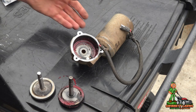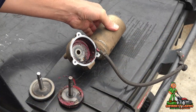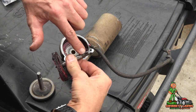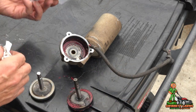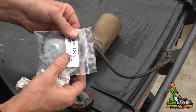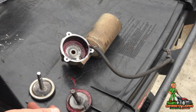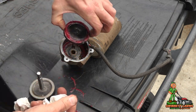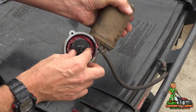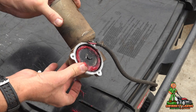So I've got the motor and everything away from the mower and the carriage. Now I messed up — the woodruff key that fits in here disappeared. Thank goodness he sends a brand new woodruff key in this parts bag. Basically the way that this fit in, it just goes in just like this — this is the old one, obviously. And then the shaft sticks out like that, just pops out.